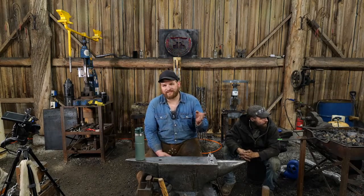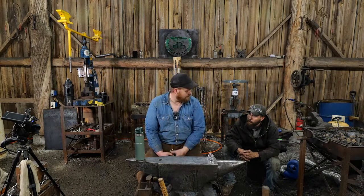So when you look on there and they're saying, happy, fun, sunny time, you buy anvil, cast steel, forged, fun, and that's their listing, it's a pig in a poke. You have no clue whether that anvil is cast steel, cast iron, or otherwise. Buy it, check it out for yourself. If it's dead soft, it's most likely cast iron. Ship it back, and don't mess with that.